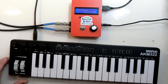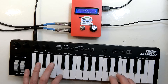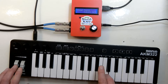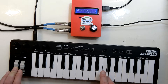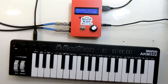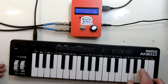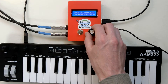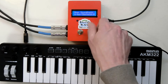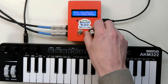But it's also a lot more flexible. You can assign any combination of sounds to whatever keys or pads you want, you can customize how the different knobs and sliders on your controller will modify the sounds, it can also arpeggiate notes, play MIDI sequences and backing tracks, and you can even build effects chains with tons of freely available software plugins. The Squishbox comes with a bunch of preloaded sounds on it. It uses the sound font file format to store sounds, and you can find tons of these on the internet, both free and paid, and you can even create them yourself.